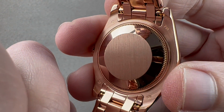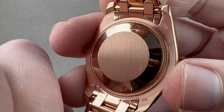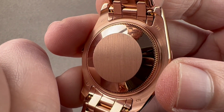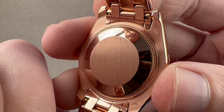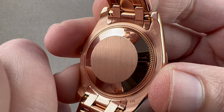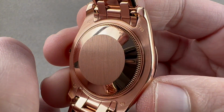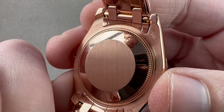Rolex caliber 2235, it's 20 millimeters in diameter, but otherwise it has the same tech specs that you'll find on larger Rolex movements. Automatic winding, bidirectional with a 48-hour power reserve, stop seconds, quick set, COSC chronometer certification. It pivots on 31 jewels. It beats away at 8 beats per second.